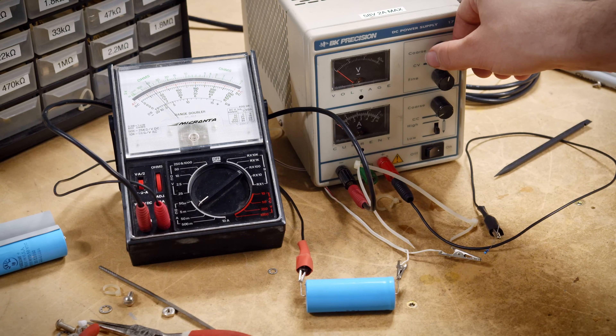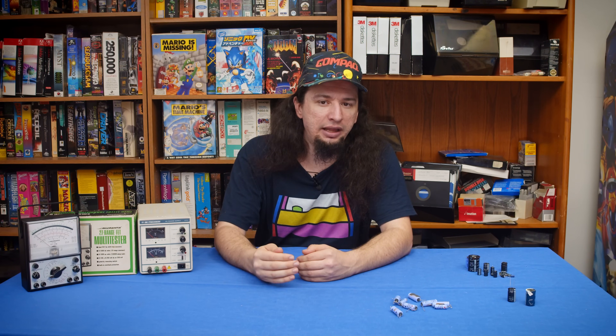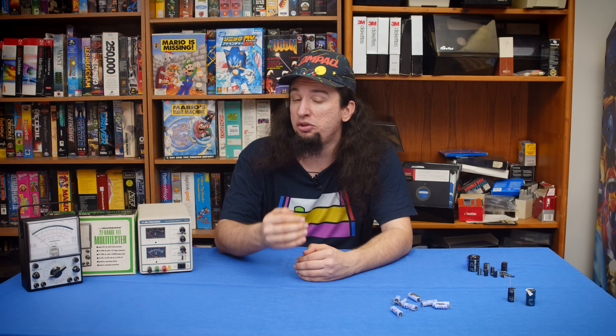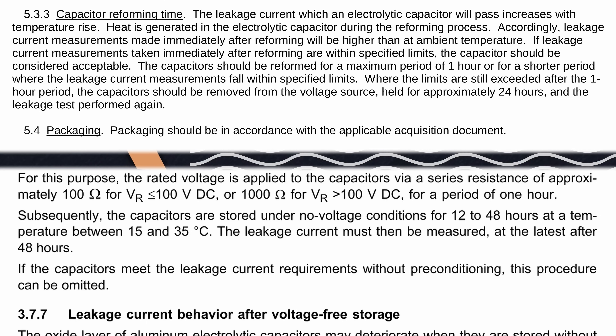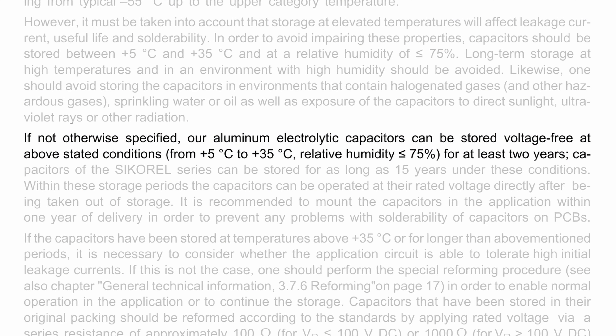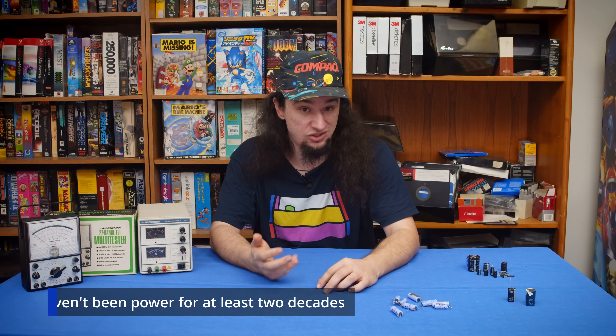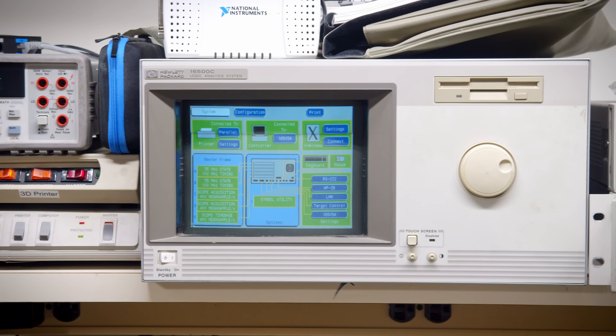Once you are there, slowly raise the voltage up again until you reach your maximum current, then stop and let it settle again. You repeat this process again and again until the voltage is increased to the rated voltage of the capacitor. This cycle can take a long time. Both of the documents I mentioned before recommend an hour total, but that is for newer capacitors — the manufacturer doc is just for ones that are only two years old. These are two decades old, so I like to take it even slower. Since it takes a while, I'm going to stop this and switch over to my better gear now.